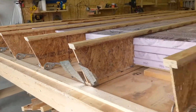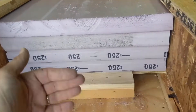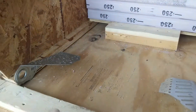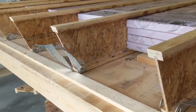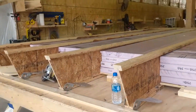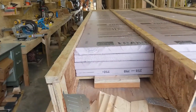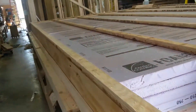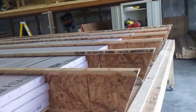This is the top end of the roof SIP and then we fill this in with regular fiberglass insulation. We need room to get in there to anchor what they call a ledger board — to bolt it to the main beam of the house. This makes it very fast and easy to install a roof system because these are 12 by 18, pre-finished.